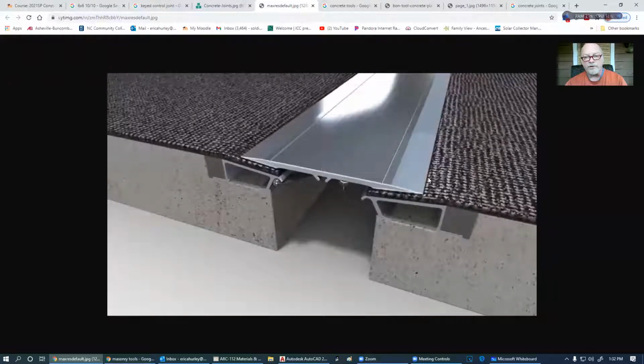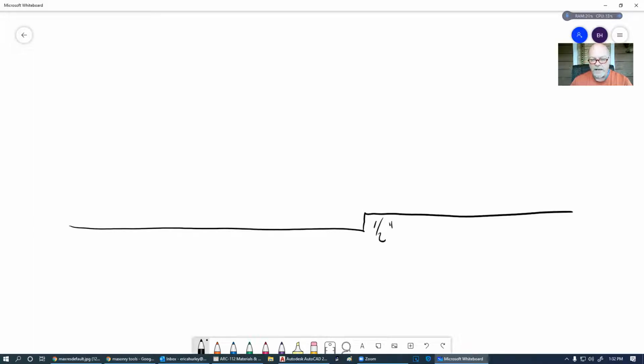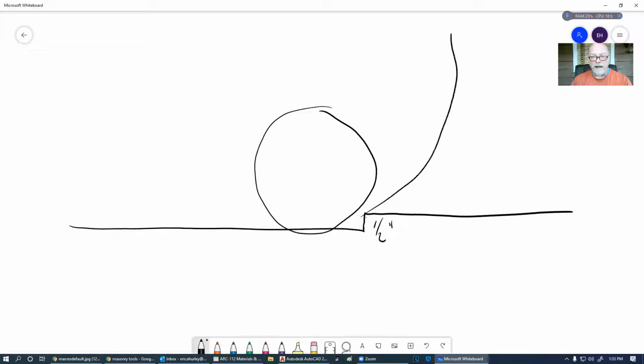One thing to note when you're talking about a wheelchair: a half an inch is the maximum rise that you can have for a wheelchair. If you're in a wheelchair going out through here and you've got a concrete lip like in my garage down there, you've got a half of an inch. Now, if any of you have never been in a wheelchair under your own power, you need to do it. If any of you have my codes class, that's one thing that you have to do. You've got to get in a wheelchair, and there are certain points of interest that you have to go to on campus. And let me tell you what, when you hit something a half an inch, little wheel, big wheel, it doesn't matter. It's going to stop you. Half an inch is like trying to climb a mountain in a wheelchair.